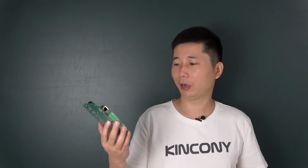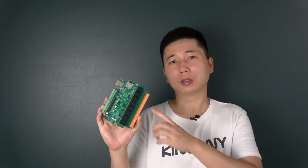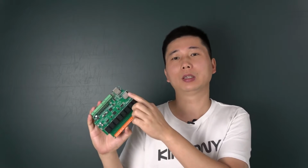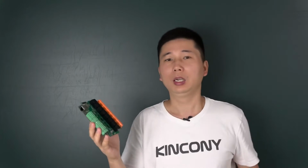In this video I will show you our new product. This is the KC868-A8. This is an updated version of the A4 board. You can also use the Arduino IDE to write any code on the ESP32 module. This board has 8-channel relay output and 8-channel digital input. This time the most important feature is the Ethernet port. It is also a good board for school IoT education or for small projects. You can use the board to write any code by yourself.